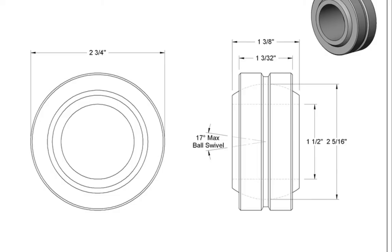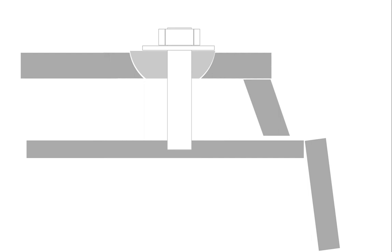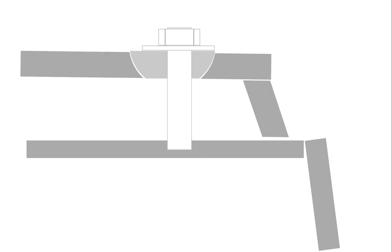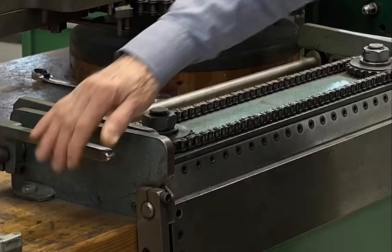I was thinking more and more about what's going on under there with those eccentrics. I started looking at these weird swiveling bearings on McMaster-Carr that are kind of like a spherical section in a bearing ring. I thought: what if it's like a hemisphere? Here's your brake and the brake apron is going up and down, and then you have that rocker structure — what if it's carried in that eccentric as it spins, sliding back and forth? And because it has that hemispherical cup design, it holds the whole thing more tightly together and allows for that rocking motion. So that's basically where I'm at with it.